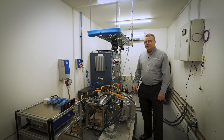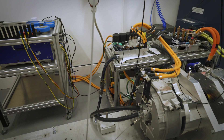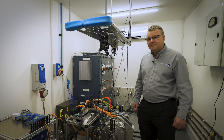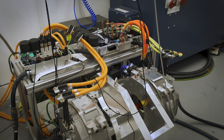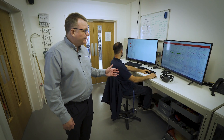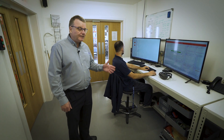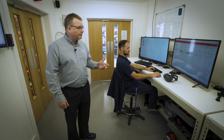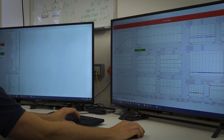We have three motor test dynos that we've built. Here we can run two of our motors back to back and fully calibrate and test the motor and the inverter with our analysis software. We can do drive cycle analysis, durability work, and more on these three dynos. Javi is just about to start running a test on the rig. We can set the voltage to whatever we need — it's currently about 700 volts — and then run drive cycles or fixed point tests. At the moment we're doing some calibration work looking at the temperature of the motor at certain operating points.